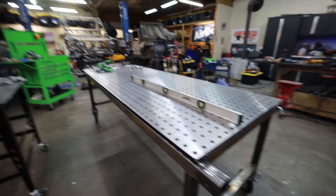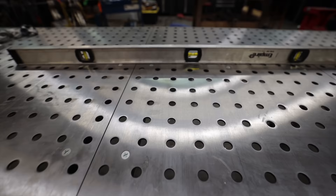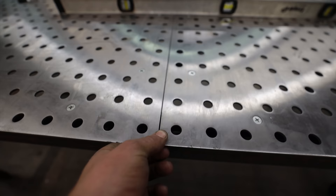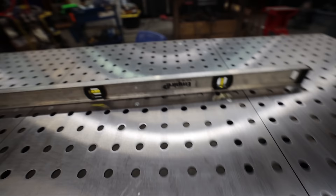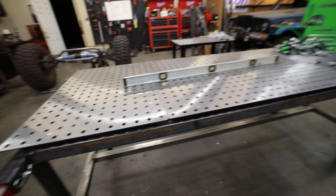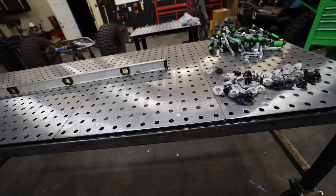Nice big flat-ish table — so how did we do? My four-foot level tells me we are not exactly perfect, but honestly a lot better than I would have expected. Certain spots feel perfect from side to side, but toward the edge I can feel it catch just a little bit. If I wanted it perfectly flat I could clamp down toward those surfaces and put a one-inch weld, but I don't see flatness being an issue. If flatness is standing in my way as a fabricator when it's already this flat, I think it's me not the table.